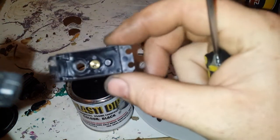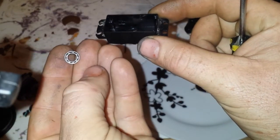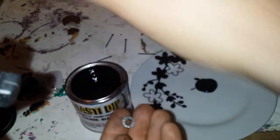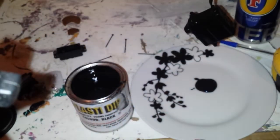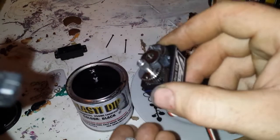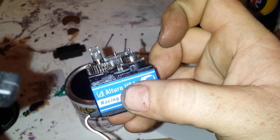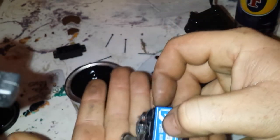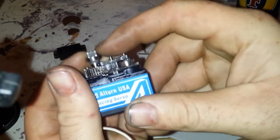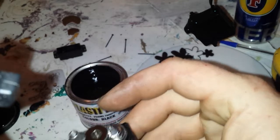Right, the bearing's out — we've now got a bearing here. Put the top half of the case off to one side for a minute. Get your servo again. This bearing sits on top of that big gear, so put it over the top like that and just press it down until it sits on the bottom.